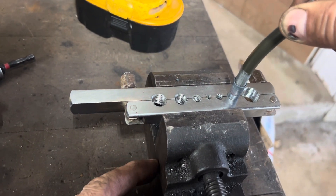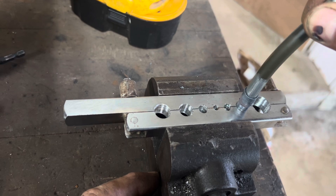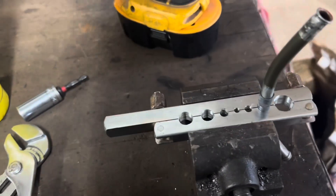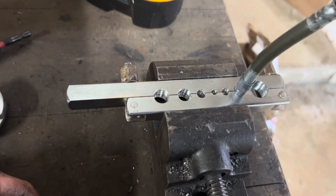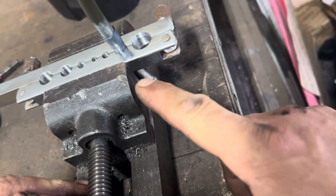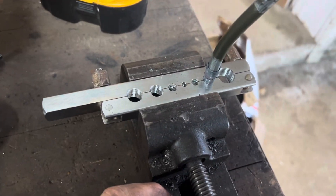Alright guys, I'm going to call that done. I just cleaned up this piece - this isn't the piece I'm soldering to the end fitting that's on the truck already. I might mess with it just to get it a little bit deeper; right now it goes down about a quarter of an inch. It's a pretty good fit - that'll fill up inside and out. I'll cap the top with solder, put the flame down low so it sucks the solder in, and that should be plenty good for my low pressure project. My piece was bent on the bottom so I couldn't get it any lower in the clamp, but I do have a little bit left and could do the bolt a little more.